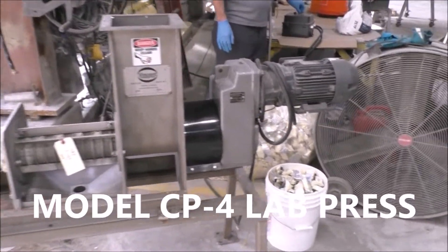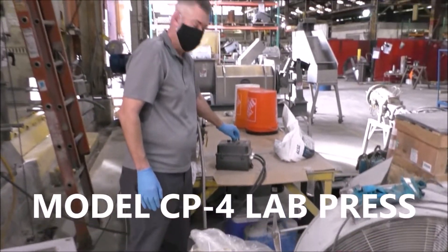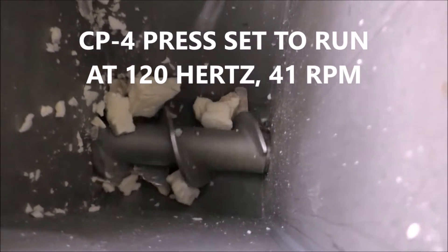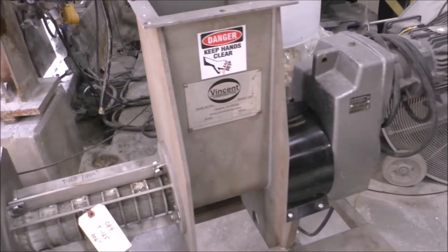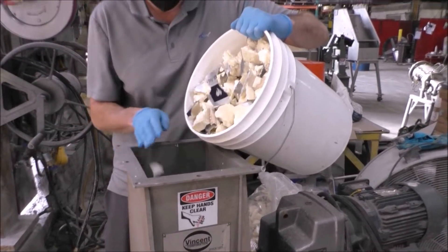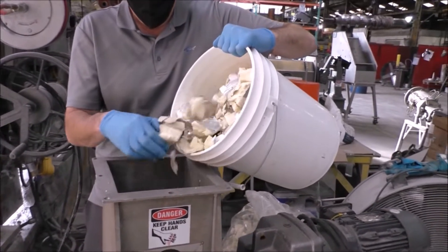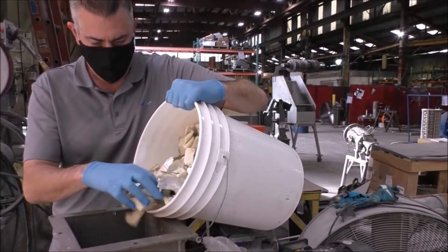Here's the press we're going to use: one-and-a-half horsepower motor, gear box, and we've got a VFD over here which we have set to run at 120 hertz. Need a lot of speed. I had put some material in already and cake is coming out. I picked a real high speed — double the normal — 120 hertz — in order to get some throughput capacity. Hopefully it won't trip out; we've got half the torque at double the hertz.